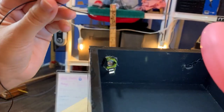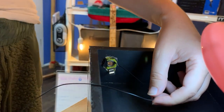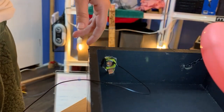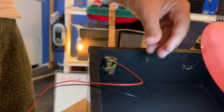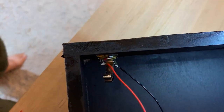Now it's time to bring the leads and the conductors together. All I did at this point was touch the ground lead to the ground conductor and bring my soldering iron down on them to melt the solder on both surfaces. I did the same with the signal conductor. I tugged on the piezo leads after I made the joints to make sure that my connections were secure. I'm done with the soldering.